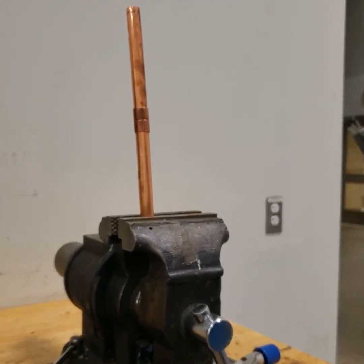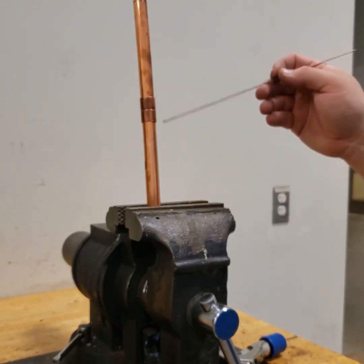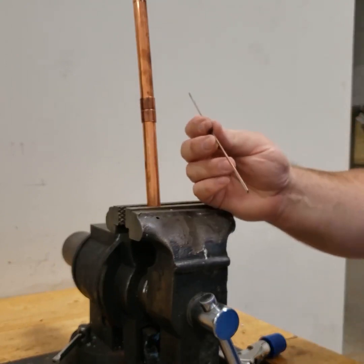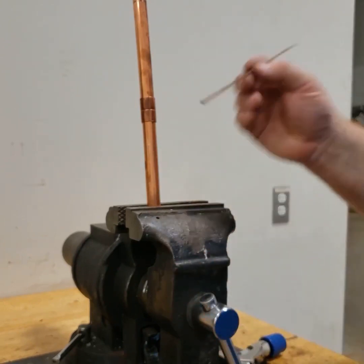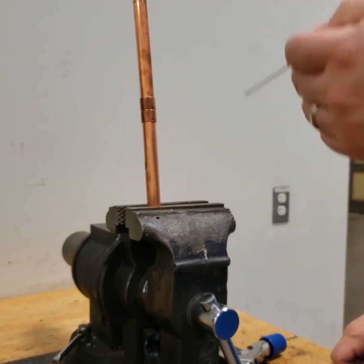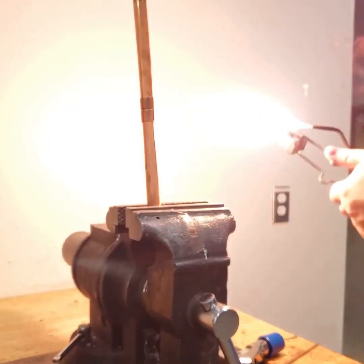What we're going to use to braze with is this brazing rod. Most brazing rods are similar — there's some type of alloy. These brazing rods don't require any flux. They do make some brazing rods that are 45 silver that require either a flux on the outside — some have a blue flux coating — or you put brazing flux on first. This is a 15 silver rod called Harris 15. It does not require any cleaning of the joint; if it was really dirty I would sand it clean, but it doesn't require any flux.